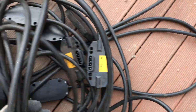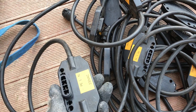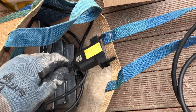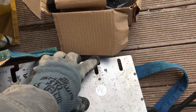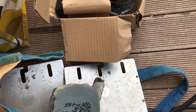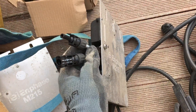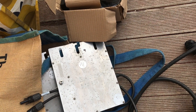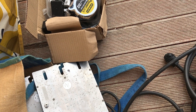Here are the bits we've got. This string is a continuous wire, and at intervals along it there are these connectors — that's where the micro inverters plug in. Here are the micro inverters, with a very weatherproof plug, and once they're in they need a special tool to undo them. Then we've got the bolts that go onto the rail — each micro inverter has a fixing point and they plug into that. The inverters have two plugs which obviously can't go in the wrong way, connecting to the panel. For the system to work it needs to be wired into the mains and the mains must be live — this is a grid-tied system, so it will not generate any electricity unless it's plugged into the mains.